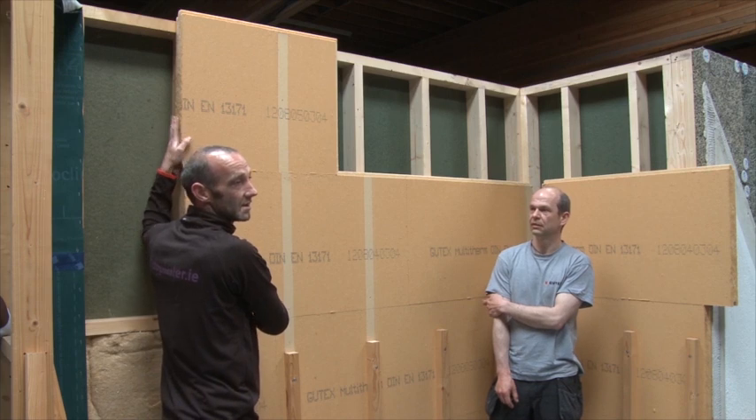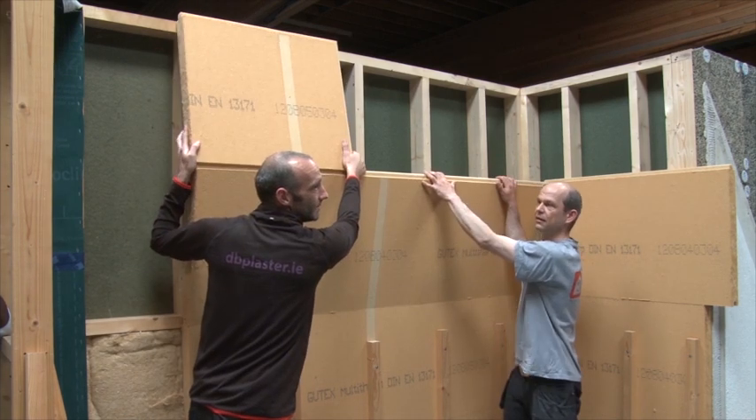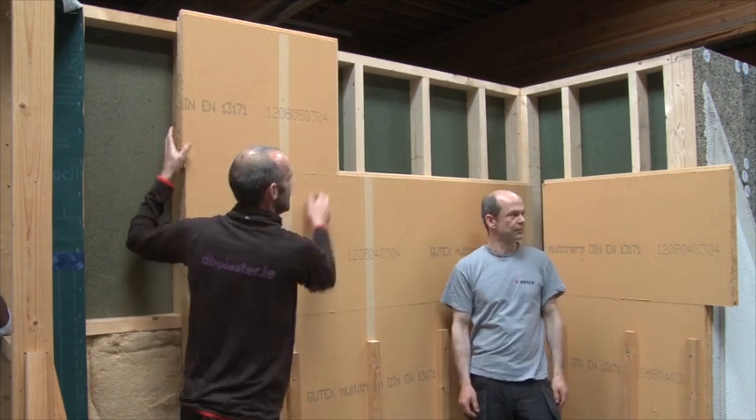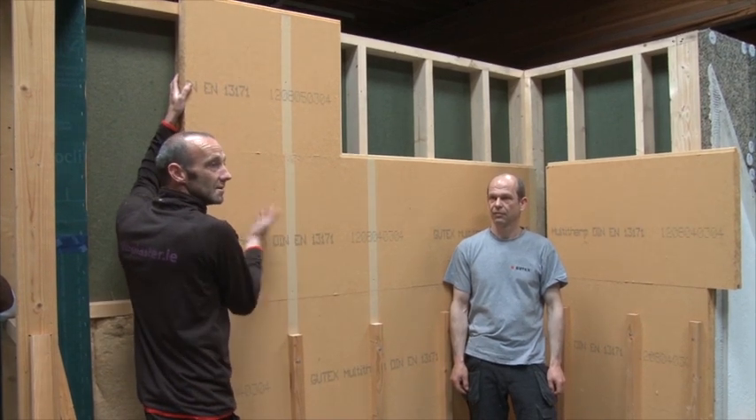You need the strength from the TNG, especially when you're not ending on a joist everywhere, so your TNG is crucial to keep that going. The shortcuts always get taken, whereas just a little trick like Roman showed you gets you in. And it's across all forms of insulation, any type of sheeting — same sort of rules.